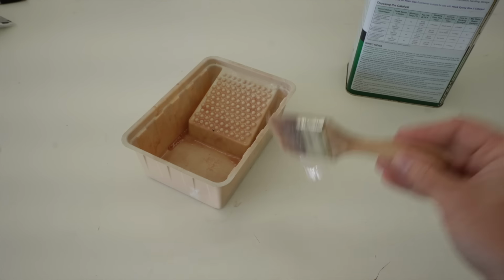The bag initially pulled down to about 15 inches of mercury, not too bad, and after massaging all of the tape around the edge of the bag, I was able to get it down to 20 inches of mercury, so that's pretty good. It's been over 24 hours, and the leftovers look rock solid, so let's pull that bag off and see what we've got.